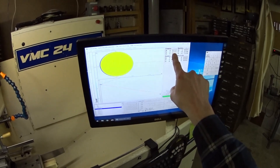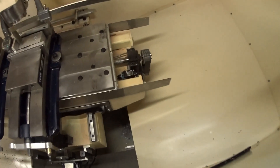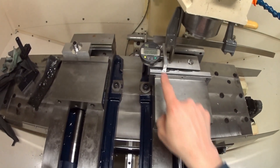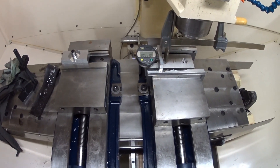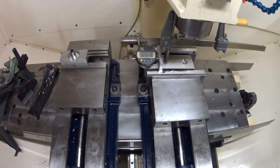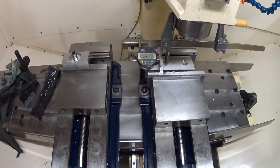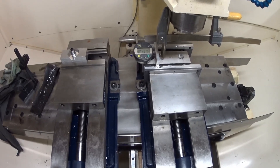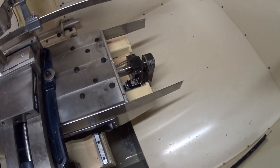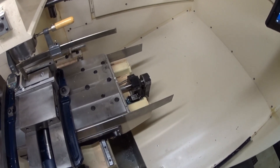So the first move is five thousandths, ten thousandths, fifteen — and there's the actual measured — twenty, twenty-five. So far we've got a one tenth accumulated error. It'll go for one full revolution of the screw, and I actually do maybe three revolutions and check it in different spots, then we'll plot that and see how it compares to what it was before.